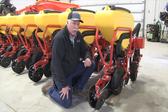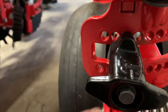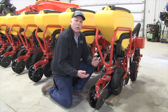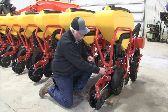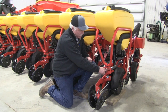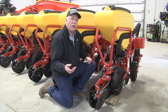So now we're holding the gauge wheels up an inch and a half, and then we just take our T-handle and we tighten it up to there. 3 and 3 is where I'm at. That means this planter at 3 and 3 theoretically is an inch and a half — it will change in soil conditions, downforce, and all those things. The principle is to do this test on all the other rows and see if those T-handles also line up with 3 and 3. If they don't — say it's 3 and 4, or 2 and 3, or 2 and 2 — you need to understand that when you're in the field, a physical handle adjustment may not be the reality of the depth you're planting.